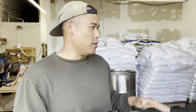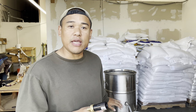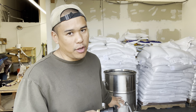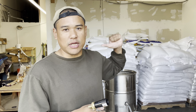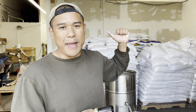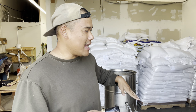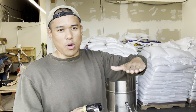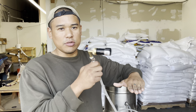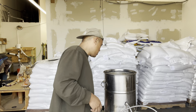This water line connects to a normal hose and supplies water to your steamer barrel throughout the whole cook. We have a heating element in here that'll boil the water; steam will rise and go through a hose that gets transferred over to our pasteurization trough. As that steam escapes you're losing water level, so the float valve kicks on and adds water.